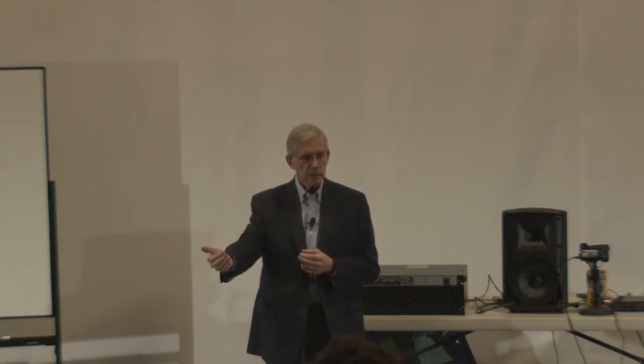Now some manufacturers, we sell a manufacturer, who's the manufacturer that makes the electrostatic? I can't think of it now. Alcons. Yeah, we sell Alcons, and Alcons takes their negative feedback loop all the way. They let it go through the speaker wire, and so you're taking it right off the input of the speaker and feeding it back. So it's compensating not only for distortion in the amplifier, but it's also compensating for losses in the speaker wire. And Alcons isn't the only one that does that. There are a number of manufacturers that do, mostly in the hi-fi industry.